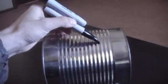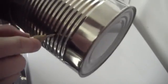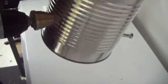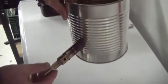I plot out where I'm going to drill the holes for the legs on the can. Here you can see I've drilled the holes and installed the legs. I plot a mark where the burner will enter the casing. I center punch the mark and then drill. A larger step bit is used to finalize the diameter. A quick test fit of the burner — looks good.